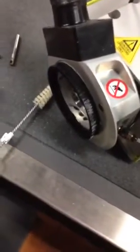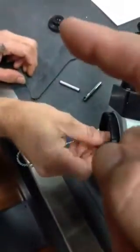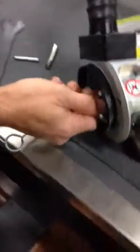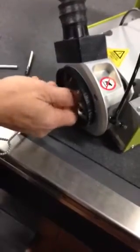No oil — you just put the collet back in again and hand tighten it. The reason it comes with that thumb wheel instead of a couple of wrenches is because we don't want you to over-tighten that. Always use the dummy bit inside of there to keep that collet from closing while you're trying to tighten it.